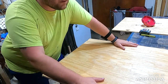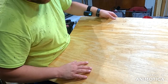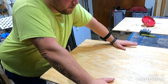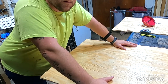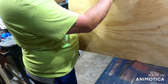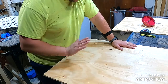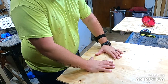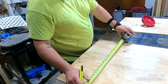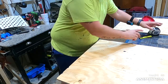When you get your plywood, before you even leave the store you need to find the right piece. You can see this piece is pitted — not great. You can sand it down smooth, or pick one with one side better than the other. From there, pick which end is better for the hole. Your hole is going to be 12 inches from the side — that's dead center — and you're going to drop down nine inches. That mark will be the center of your hole.